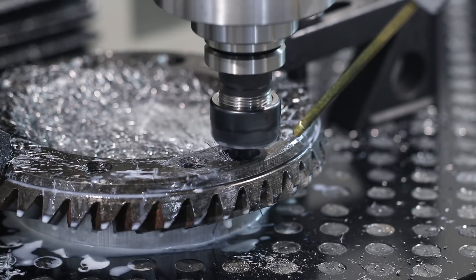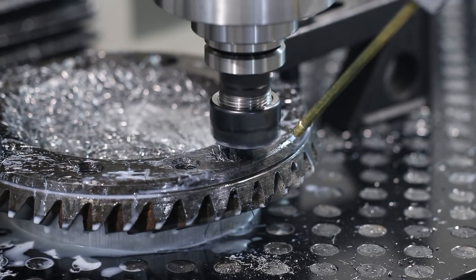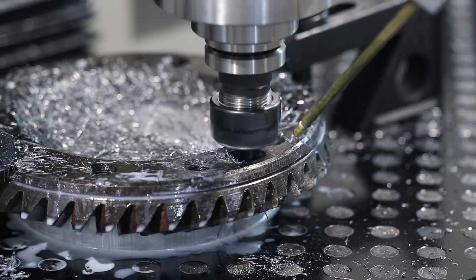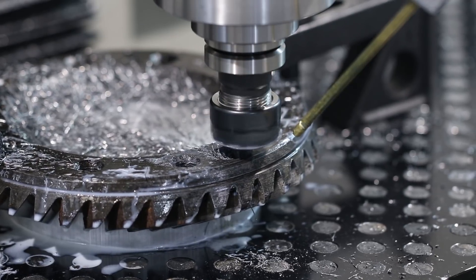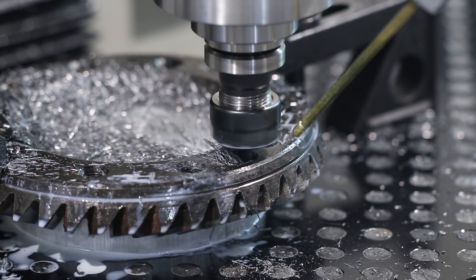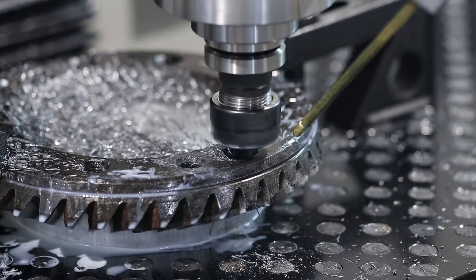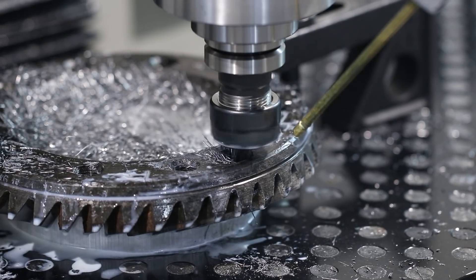There was also a really important balance in this recipe between tool stickout and chip evacuation. You want to keep the tool choked up in the holder as much as possible to increase rigidity; however, on a relatively deep feature, that makes it harder to evacuate chips. While rigidity is important, so is chip evacuation — you cannot let the end mill recut chips. At best it will mar your surface finish, but at worst it will chip the cutting edge or snap the tool. If you're using a fog buster system, make sure it's aimed well and consider turning up the air pressure to aid chip evacuation. Similarly with flood coolant, make sure it's blowing chips out rather than creating a pool for them to sit in.